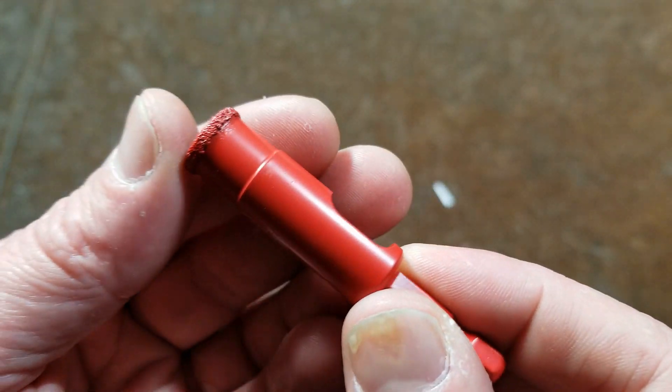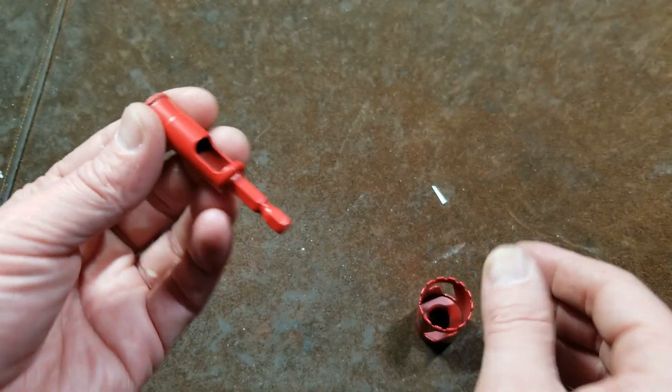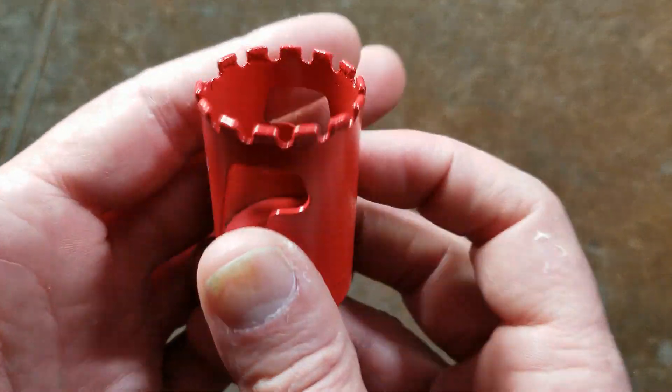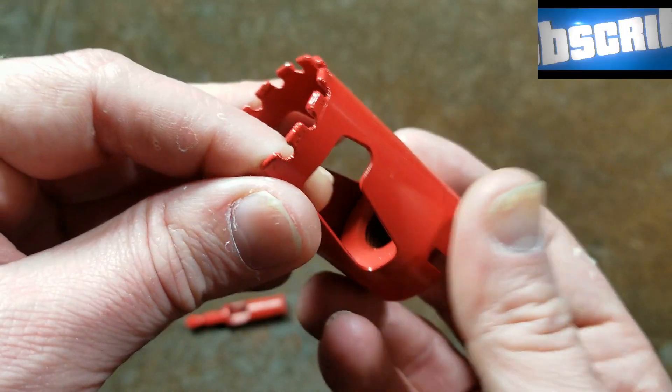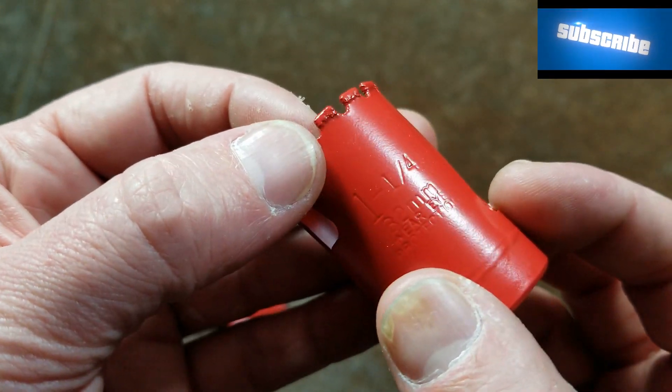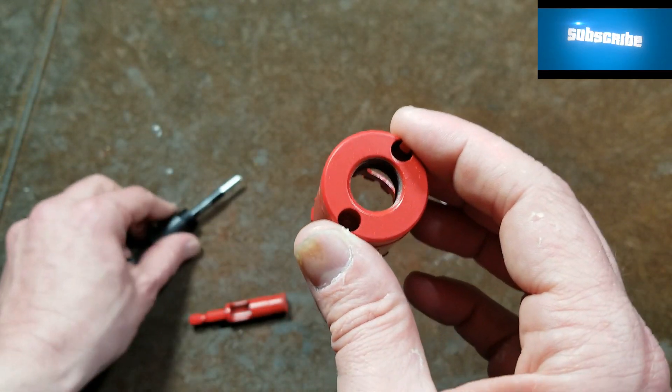You can also see that there's a little stop there, so these aren't really made for going super deep, although you can on the larger hole saws. One thing worth mentioning is they use a very thin wall — a very thin kerf — so that the diamond does clear a pretty wide area. Otherwise it's just a standard half-inch two-pin.